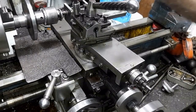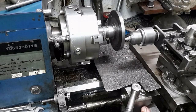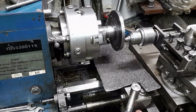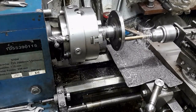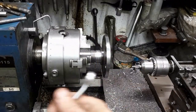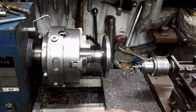The tool post drill is used to drill the bolt hole circle for the chuck retaining screws. The drill was first aligned with the lathe spindle and the cross slide dial zeroed. It was then moved outwards to the required dimension and locked. The spindle was indexed by 120 degrees using the protractor on the lathe chuck backplate.